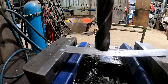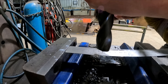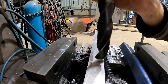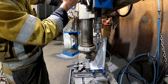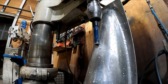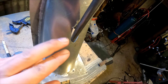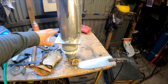A problem I had last time was drilling a hole in the intake manifold for the shaft to go through and getting it in line. What I ended up doing is measuring off the edge of the vise to where the centre of the hole will be, then measuring off the other side to confirm. Then I moved the carriage up out of the way and put a 16mm hole saw on to hole saw it down — and that hole was actually incredibly centred, which is really weird. Next thing is to weld all this part up.